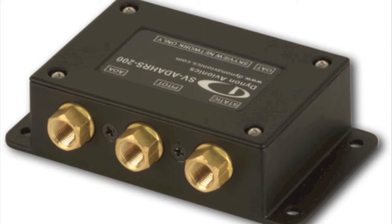These sensors include accelerometers, which measure forces in all three directions; rotational rate sensors, which sense rotation about all three axes; pressure transducers for measuring air data; and magnetometers on all three axes for measuring magnetic heading. These sensors form the core of Dynon's Air Data Attitude and Heading Reference System, or ADAHARS, for short.